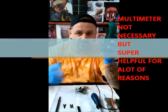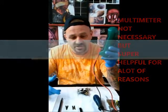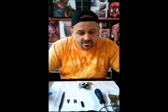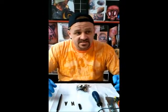In this video I'm also going to use a multimeter. You don't have to, okay? I recommend you get one, 20 bucks. It's a good tool to have to test and see what voltage is coming out of your power supply to your clip cord, to your machine, okay? A lot of times these power supplies come from different countries, they're imports, and even your American ones can be off. A multimeter will show you how accurate or inaccurate your power supply is. If it says 7 on a power supply and you put your multimeter probes up to it and it says 6, you know you're off by a volt, okay? So that's important stuff to know.